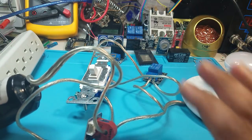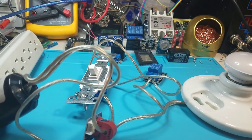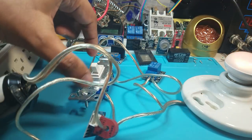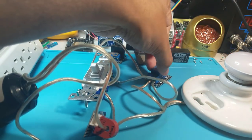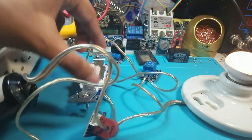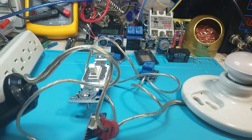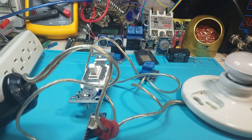Before hooking up the ESP board or NodeMCU, make sure this setup still works. I'm going to turn it on — be careful because it's now live. You can see the relay is off and not hooked up to anything, but you can still control your lights. This is very important: for whatever reason — lightning strike or otherwise — if you lose your ESP board or NodeMCU, you can still control the lights through the manual switches, which we couldn't do in the last tutorial.